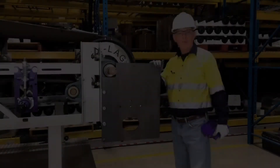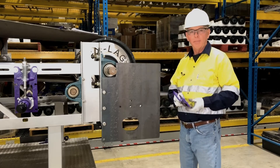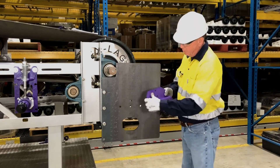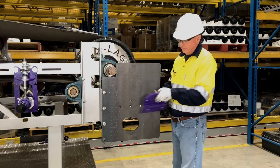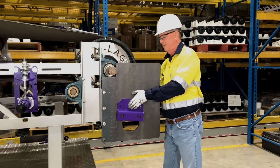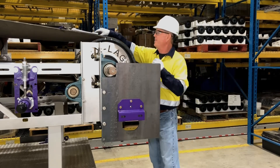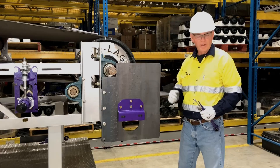Now we're ready to cut. Now that we've got our holes cut, we're ready to start installing our cleaner. The first step is to install our offset bracket. As discussed earlier, you could install it in one orientation, but because of our available steel, we're going to mount it in this orientation. We'd prefer you to install the bolts from outside to in to prevent any obstruction. Repeat this on the other side and we're ready to install our cleaner.